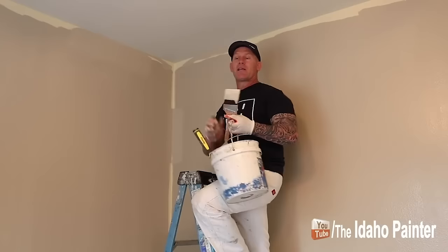Today I've got a really cool tool to show you — it's the Richards Gooseneck Paintbrush. We've used this thing quite a bit; it's an awesome paintbrush. A couple of things it does that are really unique: it bends, stays bent, and screws onto an extension pole. Where that comes in handy is a situation like this — I've got a light in the center of this vaulted ceiling and I could get up there with a ladder, but I don't have access because there's furniture covered with plastic that I cannot move. So I'm going to use this cool tool to cut in around it. All I do is screw it on an extension pole — it stays nice and tight, I can bend it, and it stays in that bent position to work around that situation.